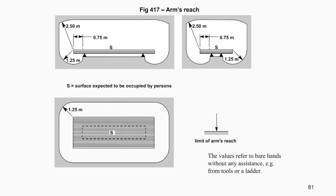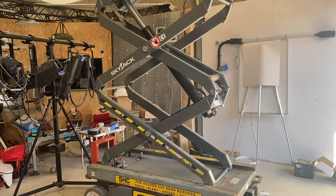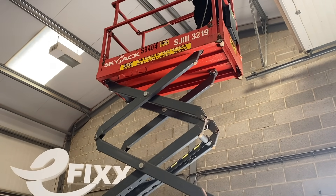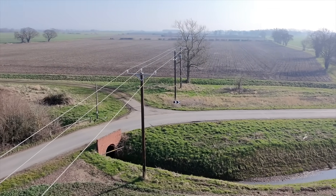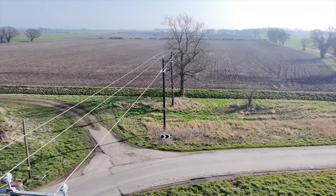The same applies vertically — arm's reach upwards is 2.5 metres from the standing surface, regardless of what's in between, unless it's properly rated. And just like with obstacles, this only applies to direct contact by someone standing and reaching with bare hands: no ladders, no tools, just normal movement. So both of these methods — obstacles and placing out of reach — can protect against shock, but they're only effective in the right environment and only for the kinds of risks they're designed to prevent.